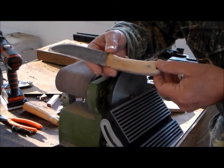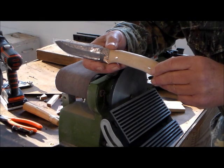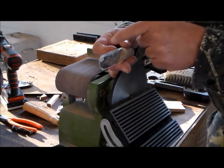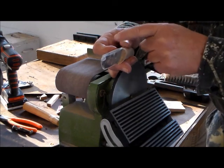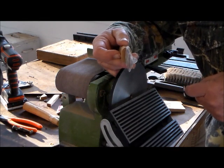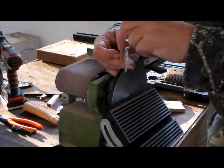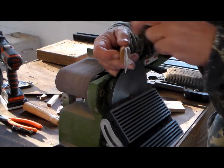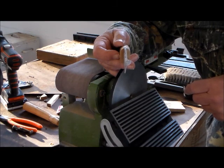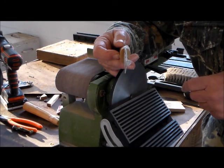It's much more friendly to the little finger when you actually grasp the knife. We've also rounded it a little bit more and thinned it a little bit more, and we're now ready to just about take it inside and do the hand sanding and finishing. We did also correct the length of the scales here, so now they are both at the same length, whereas previously one was just a little bit more forward than the other. So we took care of that, and now we just take it inside, sand it, and get it where it looks really right and symmetrical, then start putting some stain and finish on it.